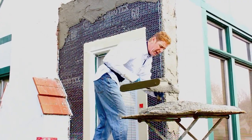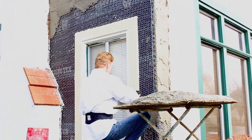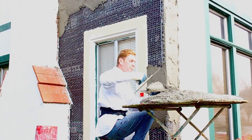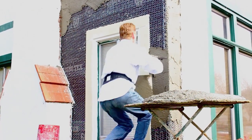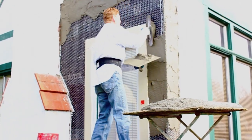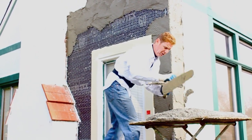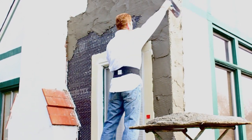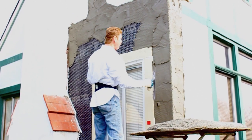And this is just the first coat now. We're not doing it in traditional where I'm going to put the first coat on right now. I'm going to follow right back up after I scratch this whole thing, then I'm coming with the next coat because the paper is absorbing some of the moisture right out of here. Of course, you gotta know what you're doing. If the weather's cold, then you have a different system. But right now, for the sake of what we're doing, I'll start from the bottom. That way my next coat tops it and it doesn't just fall off.